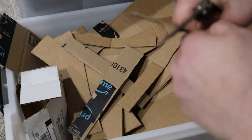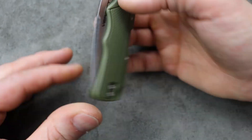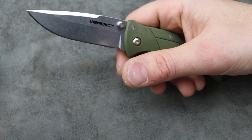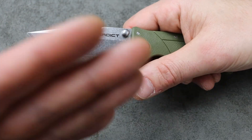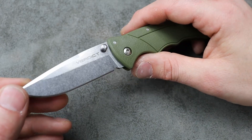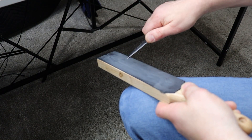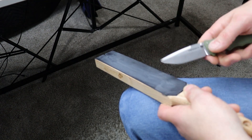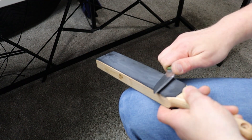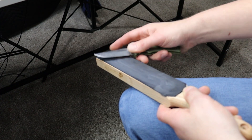The HRC on it is not very high — I think it's around 56 HRC. So it is on the softer side of steels, which is probably why it's so tough. But somehow the edge retention is still pretty good. It's going to be a steel that's very easy to sharpen, it should hold a good edge, and it should have fairly good edge stability. Not the best edge wear resistance when comparing to all steels, but it should be plenty good for those looking for a work knife.